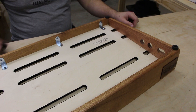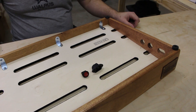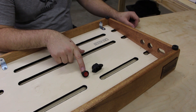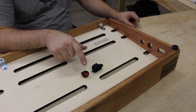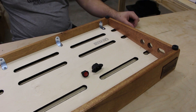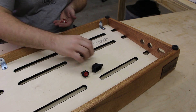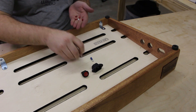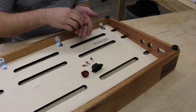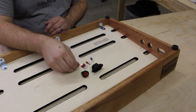To get started, you'll need an IEC socket and a power switch. Make sure that you have ones that are rated for each other. For instance, this is a 13 amp power switch and it's AC current — don't accidentally buy one that's DC current. To do it the way we're going to teach you today, you're going to need what's called spade connectors. You'll need one with the larger diameter and five of the smaller diameter, all having the same blade measurement.